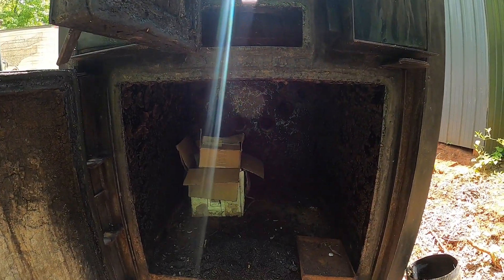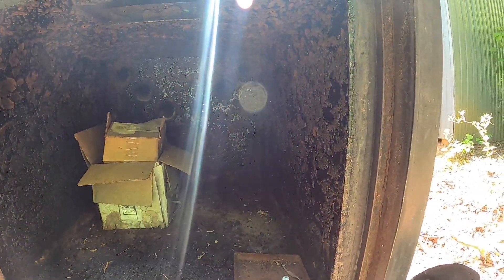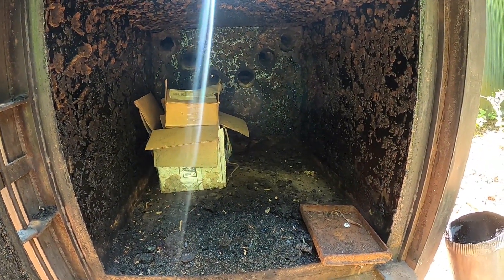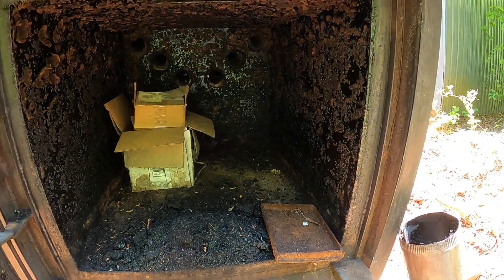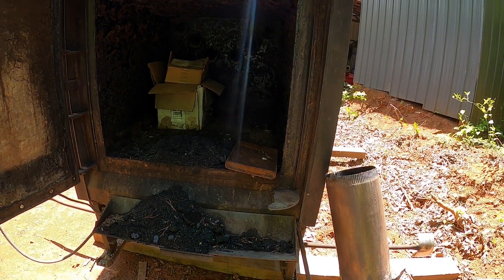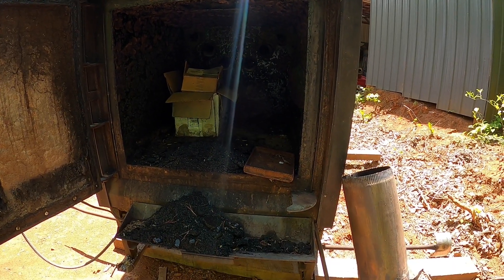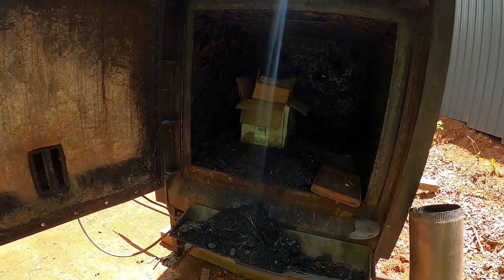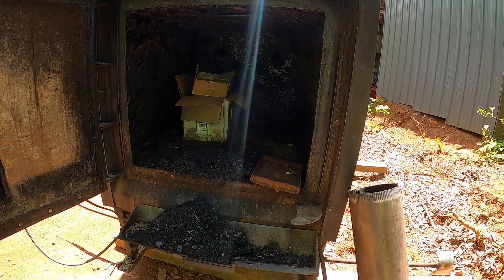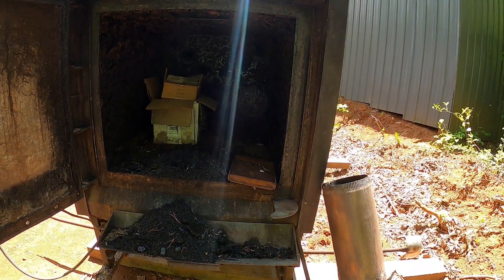I understand how this is efficient in heat transfer because it's running the hot smoke through those flues or baffles to the back, and then runs it again through the water tank and out the top — so there's a lot of heat transfer involved. The downfall, especially from where I've been trying to chip all this mess out, is clogging up with creosote, because that's just the way a water stove works. It shuts down and smolders, and when it's smoldering you get all that smoke built up and it just forms creosote on everything. With a Hardy water stove it's not an issue because once it fires back up and gets to burning hard, it'll burn all that creosote off.